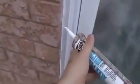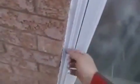Cracks on the sides because as it's dropping, it's shearing. It's shearing off. It's shearing the sides. And when you paint, you don't want to see little black gaps. It doesn't look very good. Eventually the house stops settling, but this house is not that old. It's probably, oh, I don't know, maybe 1992, something like that. So what are we talking, 17 years? It should basically have stopped settling now.